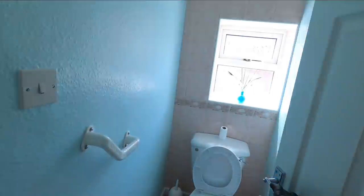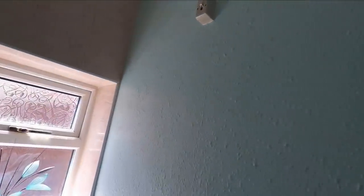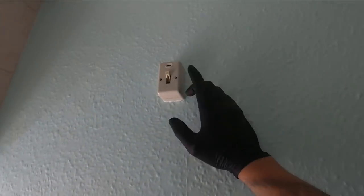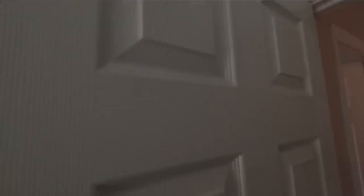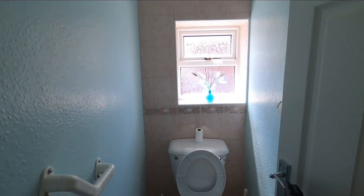We've got a toilet - literally just a switch and a pendant. There's the shower isolation - change that over, put an IP-rated 2D fitting in as well. No regulations issue being just a toilet - put a pendant there. On the quotes as well put a double socket in the loft. Loft: double socket, pendant and a switch.